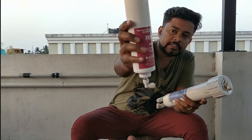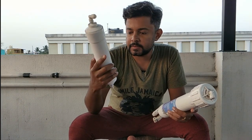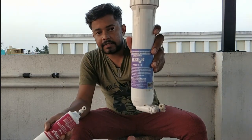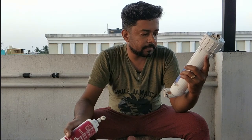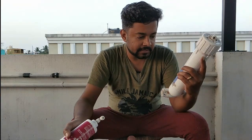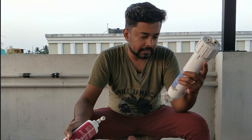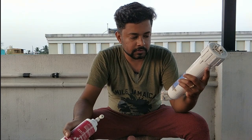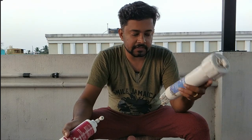Stage 1 — this red one — says sediment filter: filters out suspended impurities like sand, clay, and offers high clarity to water. And stage 3 says this comprises a semi-permeable energy-saving polyamide membrane. Besides removal of 99.9% of microbes, bacteria, virus and cysts, it also removes harmful chemical impurities, excessive dissolved salts and all suspended particles below 5 micron, making water pure, safe and crystal clear.